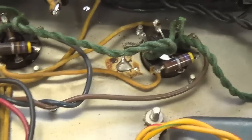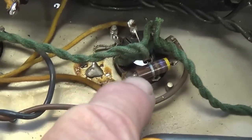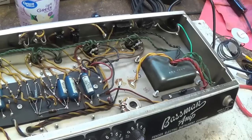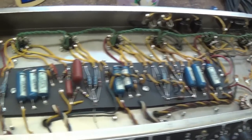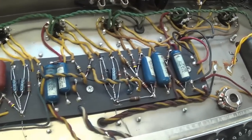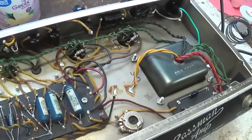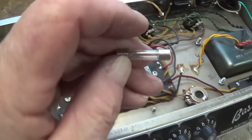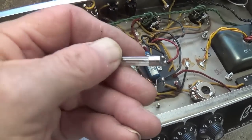Now, I think about the only thing left that we need to do is to check out the screen resistors and grid blocker resistors on the two output tubes, and then I think we're ready to do an audio check on the amplifier in its original AA-165 form. All right, as we stand, the entire circuit has received all new electrolytic capacitors, had every out-of-spec resistor replaced, three-wire power cord, switchable NFB, screen and grid blocker resistors have been replaced.